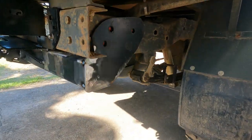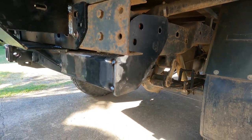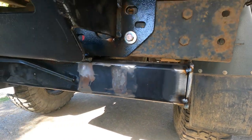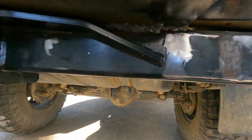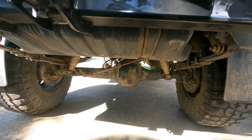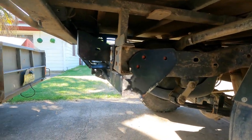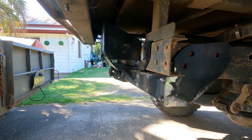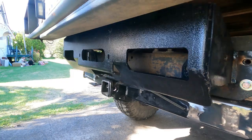That's it all tacked in place, side pieces on — just have to drill those three holes. Might add a fourth down here for an extra bolt to hold my tow bar on, so that'll be four each side. There are four bolts going there on each side. Just marked out where I need to put my gussets. It tucks up nice and tight — still higher than the fuel tank — doesn't really change the departure angle that much. There's a nice bit of room in here to stuff that rear winch in.